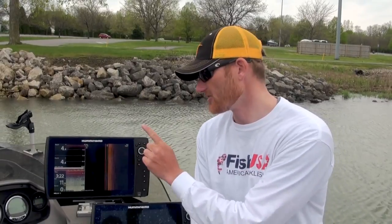Another backup option — not my favorite — is a glued-in or shoot-through transducer where you go through the hull. That's a good backup in case something happens, like hitting a log. Just a total backup option, though it won't be quite as sensitive because you're shooting through the boat, and position is super critical. So choose the right transducer, the right frequency, and experiment with it, because each individual application is totally different. Those minor changes will make sure you get a great picture and find the fish quickly.